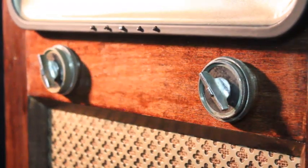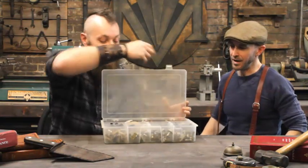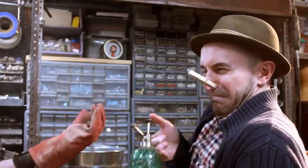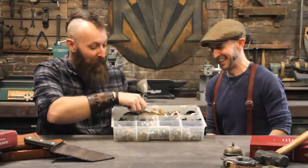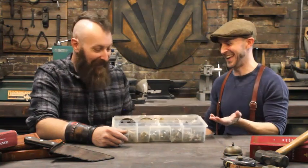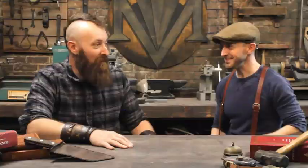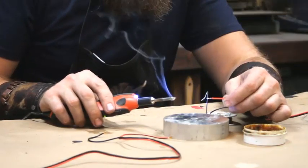Design-wise, of course, you've got to have those big chunky retro knobs that the old TVs had. Fortunately, we had a wealth of old knobs — which don't smell that great, very old smelling. We need to decontaminate these. Going through and finding the proper knobs and dials to make it all fit that era. The knobs were a cool design element, but then we had to make them work. So we actually took apart the little speakers and retrofitted them to old knobs so you could still control bass, treble, and volume. We had to take the whole speaker apart and re-solder cables throughout the whole TV — micro-solder, because things are so tiny. But once it was all in there, it all functioned and you'd never guess we had to do that much engineering.